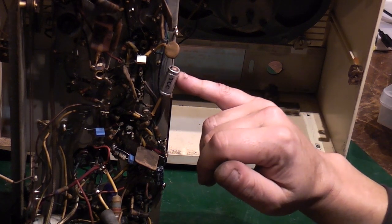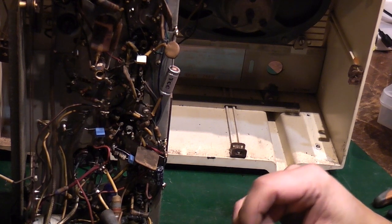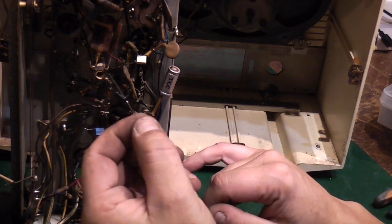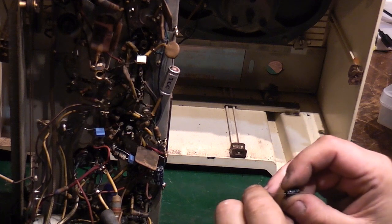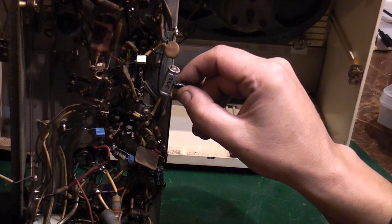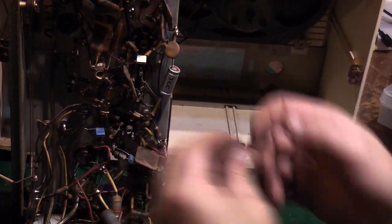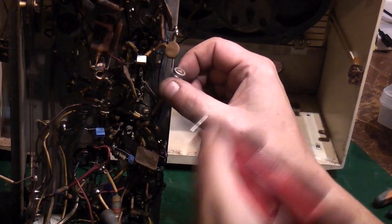That old TCC capacitor is rated for 12 volts. That modern one, that's a 2 uF capacitor, a 2.2 modern, rated for 63 volts. So yeah, I want that to go in basically like that. It would be better if we had an axial capacitor, but again, I'm using what I've got. I'm not buying anything in for this. I'm just getting this radio into a state where I can plug it in the kitchen and use it.